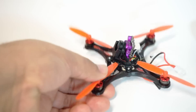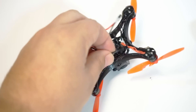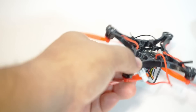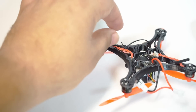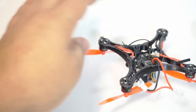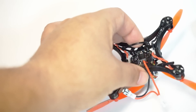As you can see, it's very tight tolerances with the prop clearance right there, but it does fit just fine. To secure the battery, I'm going to probably get some rubber bands, but I didn't have the right size so I just used a very small zip tie. I looped it through there and left a little bit on the end to size it for two little batteries. Two 300s will also allow you to fit a 1S 450 in there if you want to run 1S. There's also a little foam that comes with it so you can apply that in there for a snug fit.